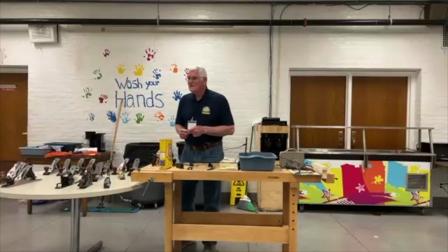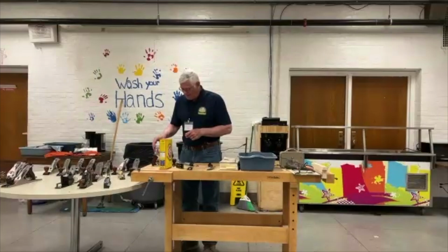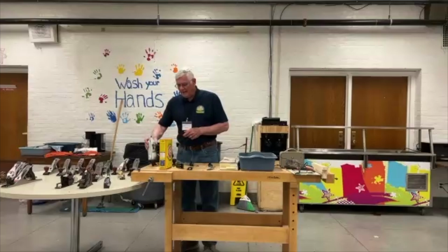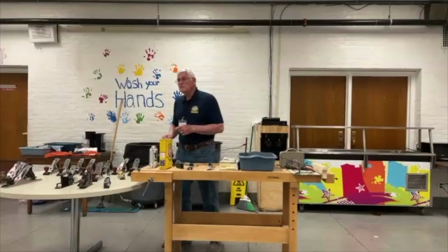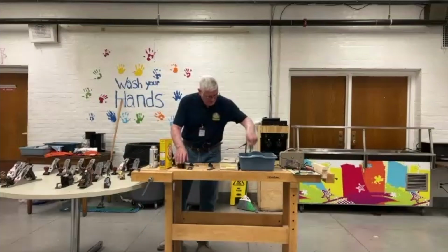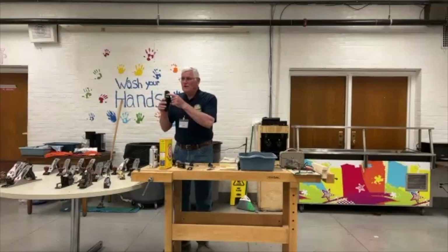Any other questions? This one, I see spray paint there, so maybe you're going to get to Japanning. Oh, yeah. Does the paint or Japanning come off in the electrolysis? Yes. And actually, when I use the grinding wheel, I try and grind as much of this body as I can. But I obviously can't reach it all. And the Japanning is still in there.